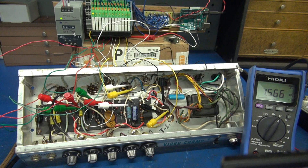Here's the test setup to automatically measure resistance and voltage on your digital voltmeter. In this case we're going to use a Fender VibroChamp as a subject. My setup is an Arduino Uno with a pause switch wired to one of the digital inputs. That drives a 24-channel Adafruit PWM module. I'm only utilizing 12 of those channels, which are feeding the Phoenix Contact DIN mount relays. This is all being powered by a 12-volt DIN mount power supply.